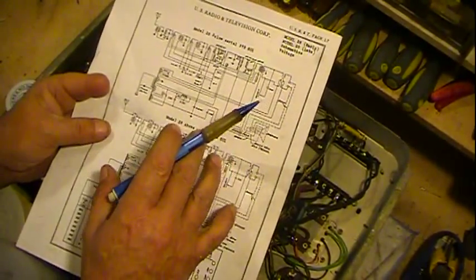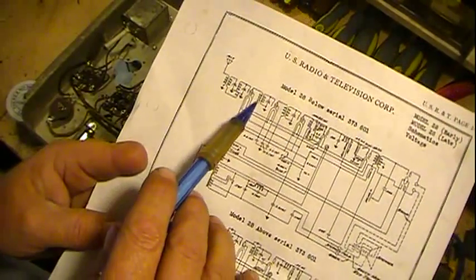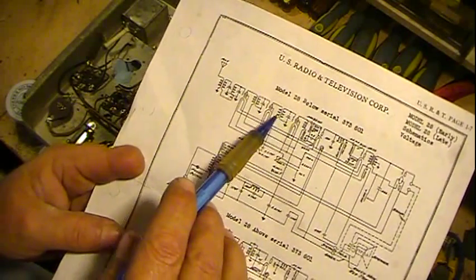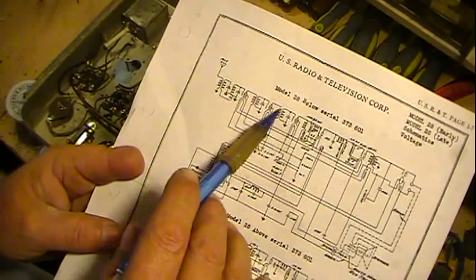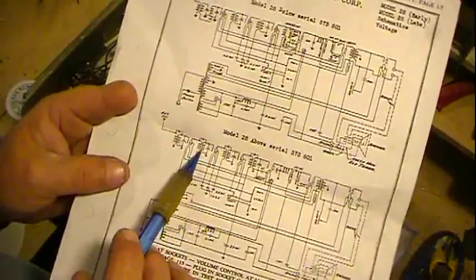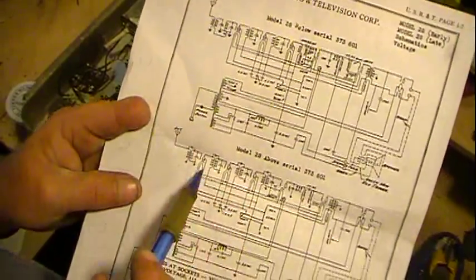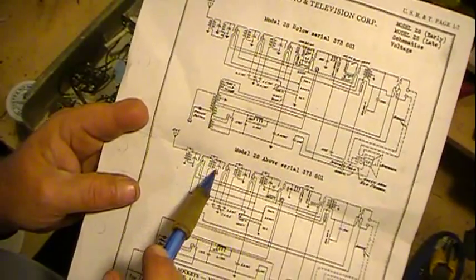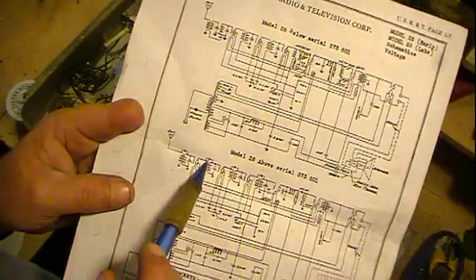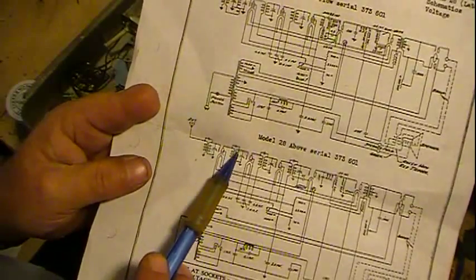if you actually look at the schematic and you're following it through, and I bring it up here kind of close, here's these coils, the RF coils, right here, going through. And you just got your basic transformers, you got your tuning capacitor, and then of course your tubes. If you come down here and you look at them again, of course the antenna one up front's here. They did a little changing right here. The early model, you just had the antenna going right into the tube, and then another RF, another RF, and another RF. But on these, if you look, they actually have an extra component, capacitor, connected across here.